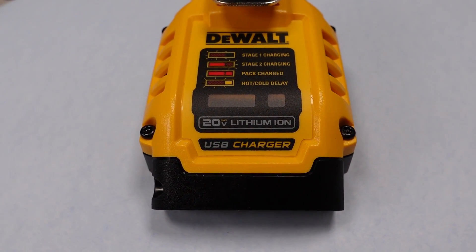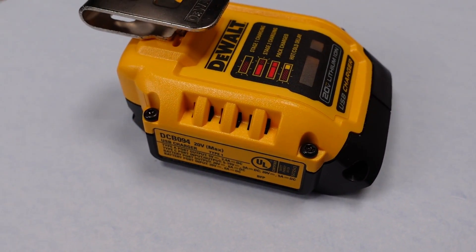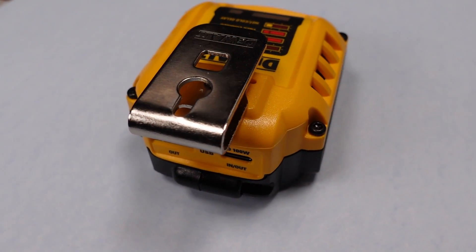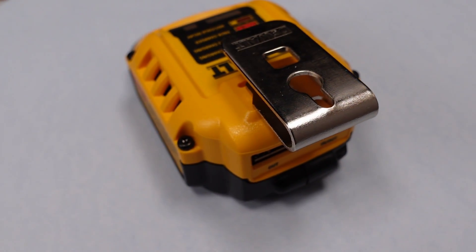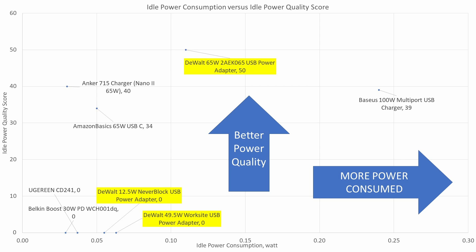I like the battery charger — this is really the win of the whole lot: USB power, interchangeable battery packs, the ability to use larger packs for more runtime. I can see this getting a decent amount of use. In comparison with other power adapters, these aren't fantastic. The efficiency in real-world mode is worse, the AC noise and power factor are worse, though the DC voltage is stable. It seems like no one makes a power adapter that can do both of these things well. I have to stick with Anker or Amazon for the 65 watt category. On the idle graph, these adapters are okay — no class leaders, but not wasting a ton of energy either. The quality is bad on the lower wattage adapters; the 65 watt is decent. They meet the Department of Energy Level 6 idle requirements. On the average power consumption graph, the AC power quality of these devices takes very low positions.